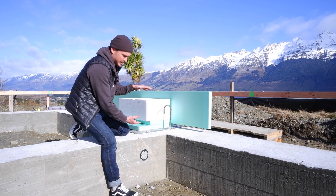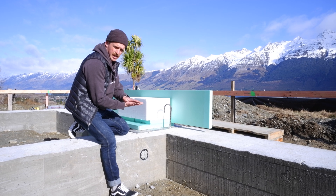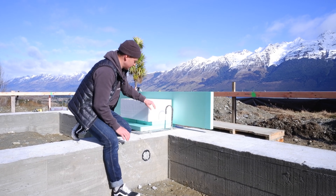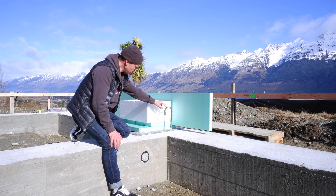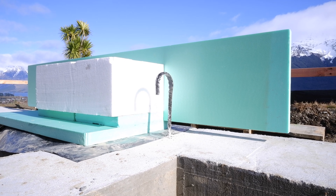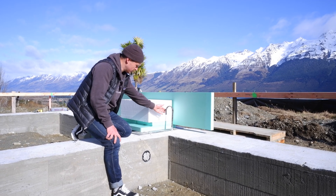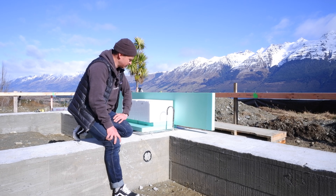We have a structural foundation and an insulated foundation, and surely you'd want to connect those two so you don't have any shear movement. This is how the engineer has designed to couple these foundations — structurally coupled but thermally decoupled. This is glass fiber rebar, used because it's low conductivity, so we won't have any thermal bridging between these foundations like you would with conventional steel rebar. It's also non-corrosive and very strong.